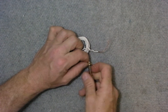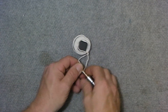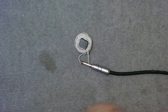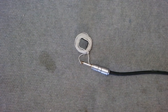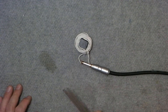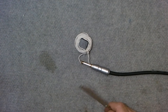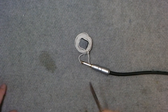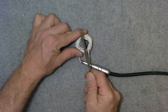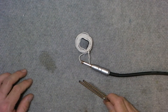So let's hook up our amplifier and give it a test run with the tuning fork. Now, this won't be very efficient — not anywhere near as efficient as the single coil I just showed, because this has got about 50 turns around it. To get more efficiency you need more turns, in the thousands. So it's not going to be super loud, but you'll hear it. And as you can see, you can hear it there. And that's essentially how a magnetic pickup works.